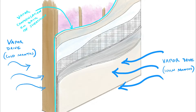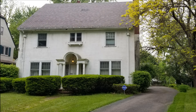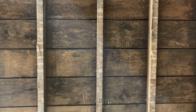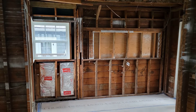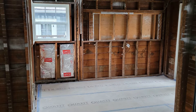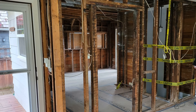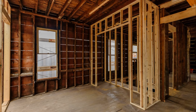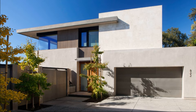Vapor will condense on the backside of the sheathing. Older stucco homes actually do quite well and have lasted many decades. This boils down to a few things: no insulation, lots of air movement, and solid wood sheathing. Older homes were often not insulated and had many air leaks. Normally we want to avoid air leaks in newer homes, however this combination allowed a lot of heat and airflow to dry out any areas that got wet behind the weather barrier. Additionally, the 1x6 or 1x8 solid wood shiplap sheathing has a significantly greater capacity to store water compared to plywood and OSB. As soon as we started preventing these walls from drying, we ran into problems.